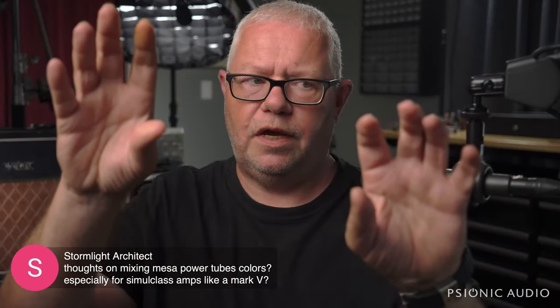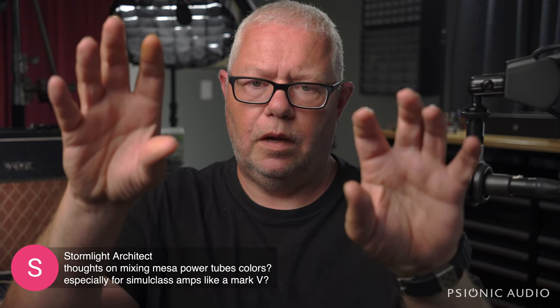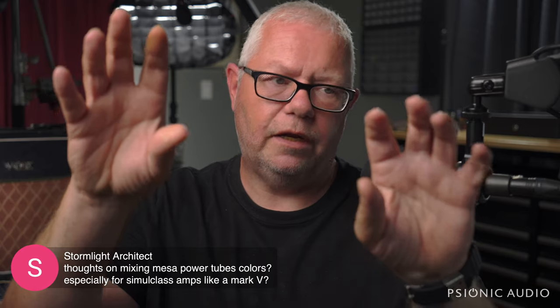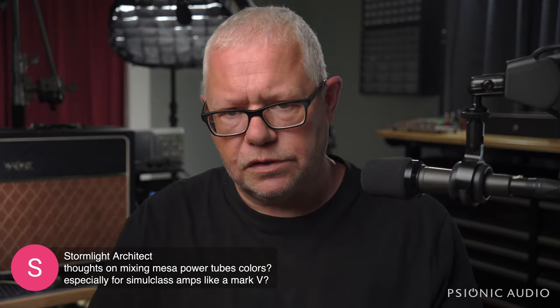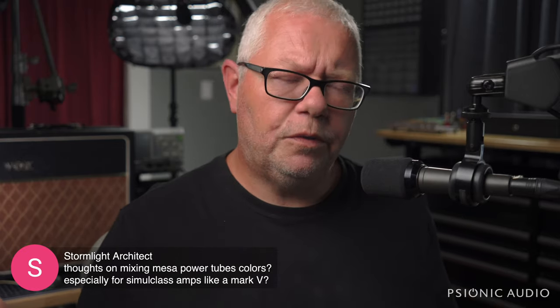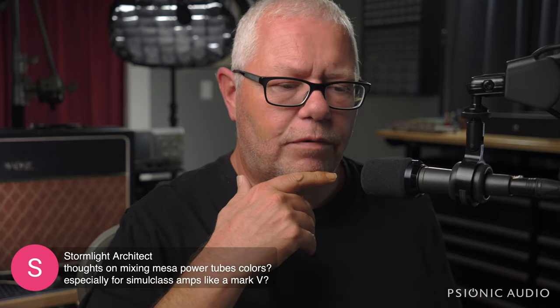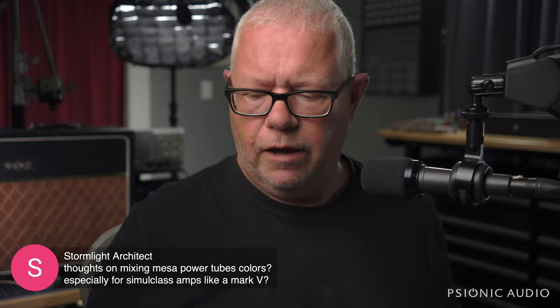So if you have one side that's drawing more current, that gets all the heat, and the other side is not going to sound very good. You're going to get hum, and in extreme conditions, you're going to have failure. So if you have all greens, or all yellows, or all blues, or all grays, you're fine. You're within the safe range.